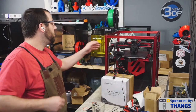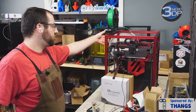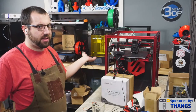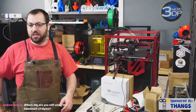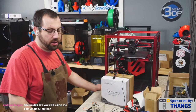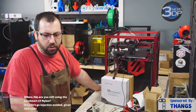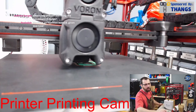There are some parts you can really simplify if you had access to CNC, like the whole XY joints, AB drives, whatnot. You can pretty much just do it out of plate steel and spacers. There's really nothing to it. I got my 3018 there. I'm tempted to try machining some parts on here out of Delrin, because the 3018 will cut Delrin pretty good. So yeah.